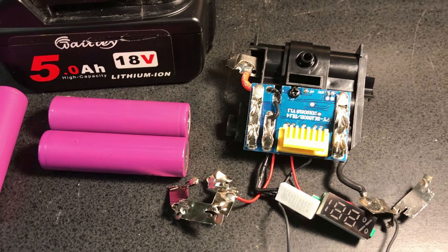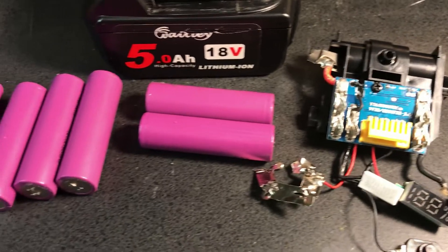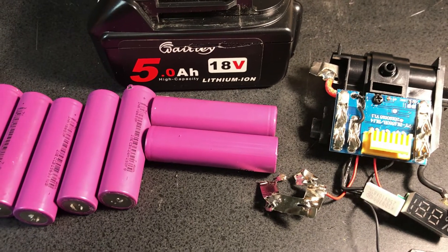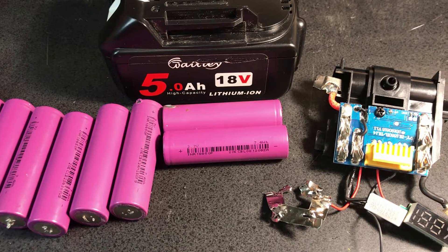The more cycles you go through and the heavier loads you put on the pack, the more cell voltages can vary. I think what happened is when several cells failed, all 20 volts was trying to charge just the remaining two. Luckily the Makita charger figured out something was wrong and stopped. Before I put these packs together, I'm going to check if I can put a real BMS board in there with real balance leads. My observation for now: there's a reason knockoff boards are cheap — they're a third of the cost because they don't do cell balancing, which leads to issues and short battery life.